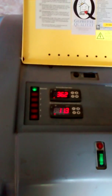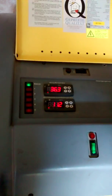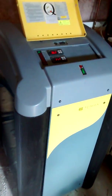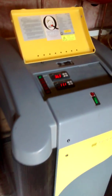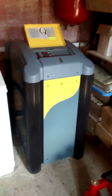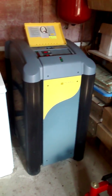The readouts here — the bottom one is the temperature of the ground source water and the top one is the house-side water. The temperature is coming in at 11.1 degrees at the moment. That's the sound of the heat pump cutting in; once it's flushed through with water from the system, it starts up using a soft start.